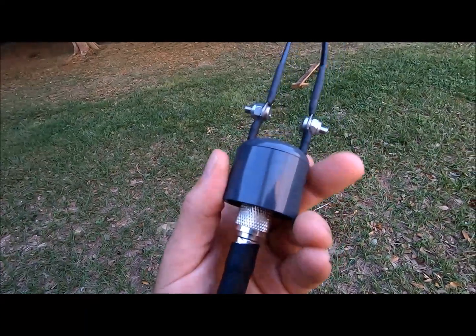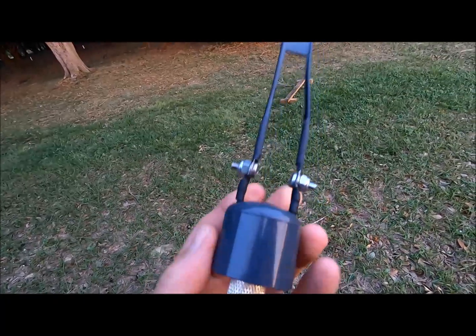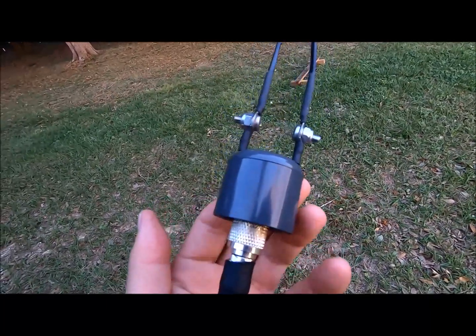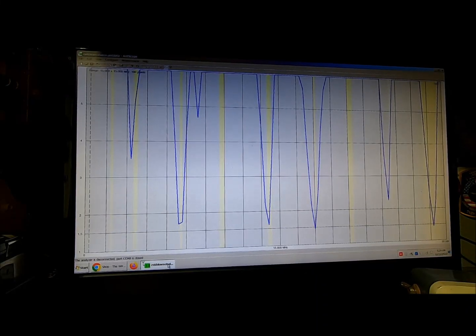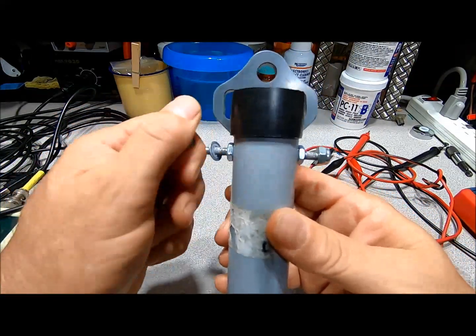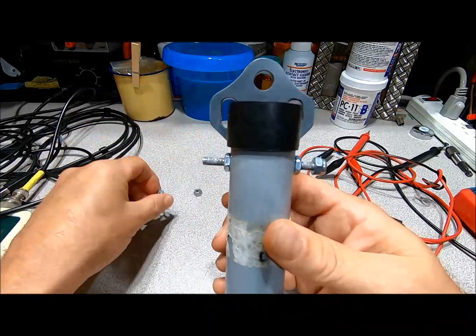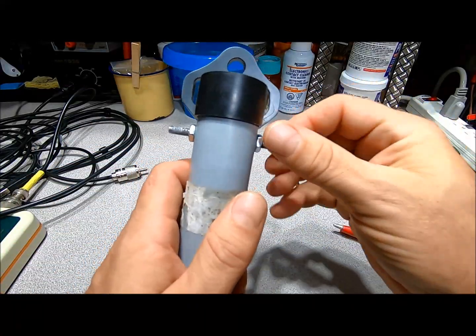In the meantime, I've got this connection here that goes from an SO-239 to window line that I'm using — it's not a balun, but it seems to be working just fine. So you can see the antenna itself survived the hurricane just fine. It was the balun that was the weak link. This is that radio-waved balun, and you can see it's already exhibiting quite a bit of corrosion on these terminals, which is not good.